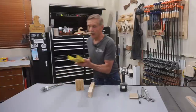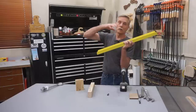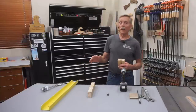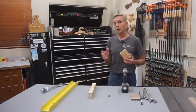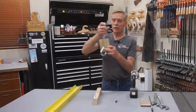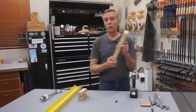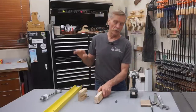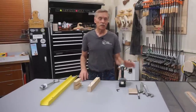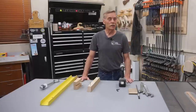For the Next Level Carpentry shop, I'm using this piece of three-inch steel channel, quarter-inch thick, to distribute the load placed on the skyhook. I'm thankful that piece of hardware will get the job done because it keeps it simple. My installation also includes a skyhook guide or spacer block, and a simple block that helps support the skyhook anchoring channel. Those components, along with a couple of screws and a basic set of tools, are pretty much what's involved for installing two skyhooks in the shop.